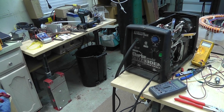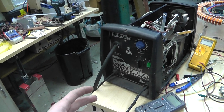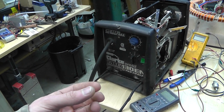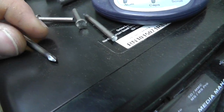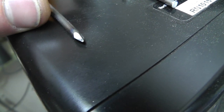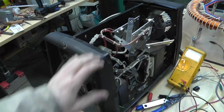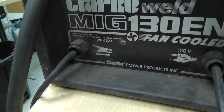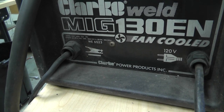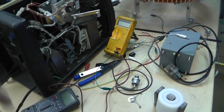But when it was working with just half the power, I was able to create basically molten metal. What I used actually was nails. These two nails right here. Now this particular welder was not able to give me that high voltage arc. It was just able to give me the amperage I needed. 30 volt DC at 85 amps and 60 amps at 21 volt DC. So I was able to get the power, but the high voltage arc I was not able to apply correctly.